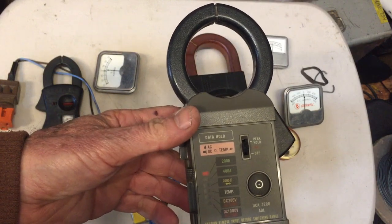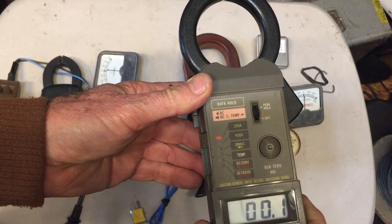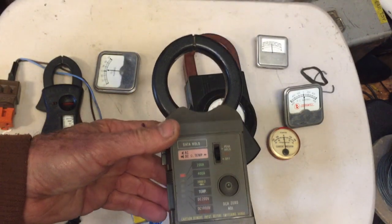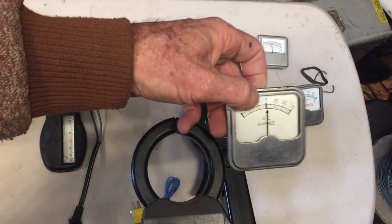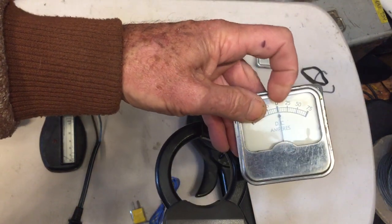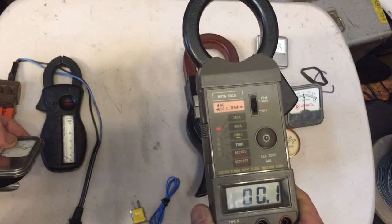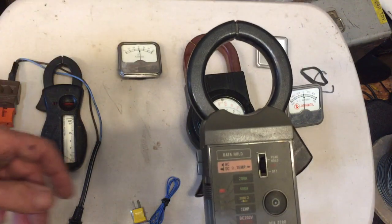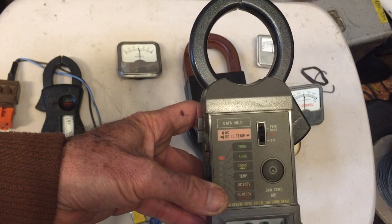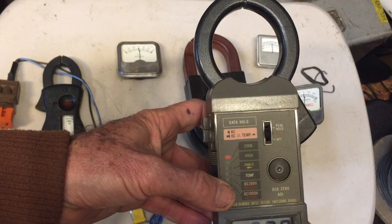I just thought I'd share that because I know a lot of you guys, like myself, do a variety of different types of work. Sometimes you're doing automotive work, and a lot of times you might want to measure the current going through a wire without actually cutting it. It's kind of hard to do with a non-contact meter like this because it requires at least 25 amps, whereas this one will measure easily a half an amp on up. Anyway, hopefully everybody's doing well out there — I haven't made a video for a while, mostly out there chasing the money. I hope you like the video; please give it a thumbs up and subscribe.